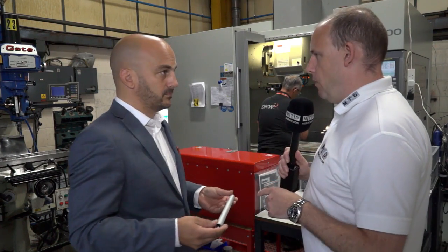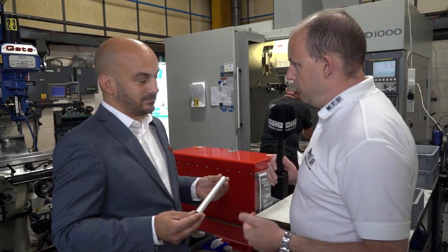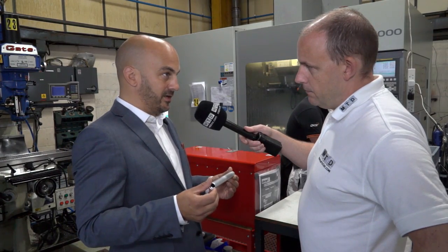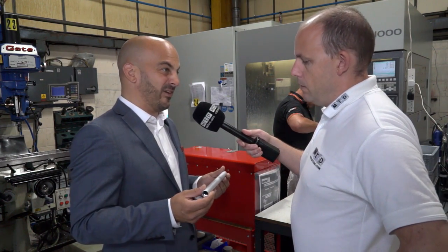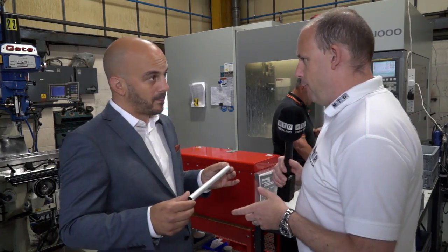The machine behind us is a Dugard 1000. I'm assuming that's doing the drilling and the tapping of this part. You've got some internal features — what are you doing those on? These internal features are done on our SB32, which is our largest capacity sliding head lathe from Star. We've got eight Stars in total. We use the SB because of the size of the material and the JBS guide bush in an SB32, so we can machine uneven bar sizes. This is extruded material, so it's not concentric, not that round, and not very tight tolerance-wise. So mainly you're turning internally and then doing the drilling and tapping.